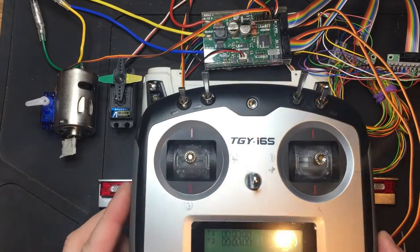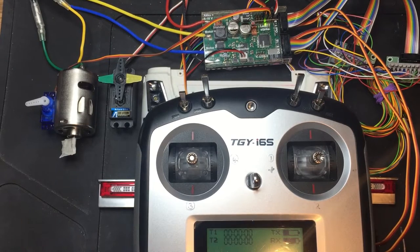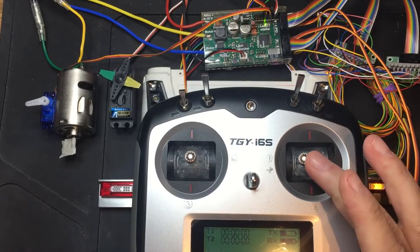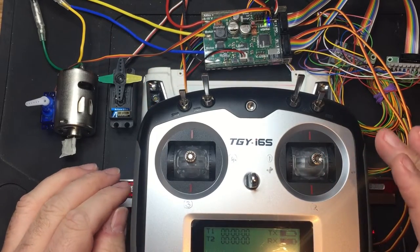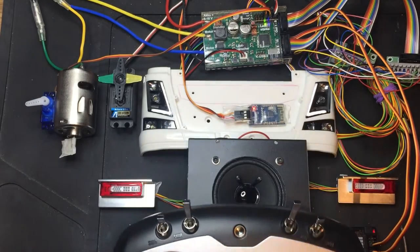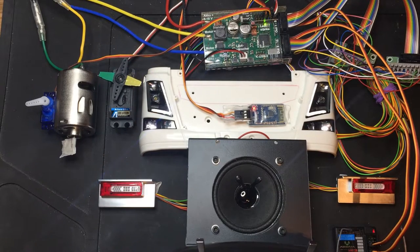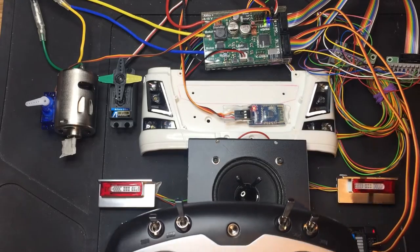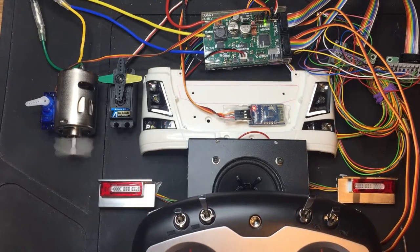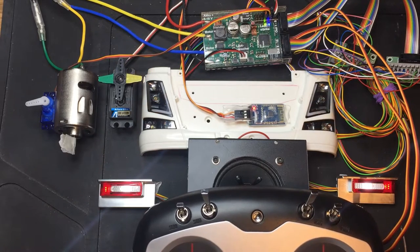So at the moment we have steering — we have left movement on the servo here and we have right. Now this will be an indication of if you only had a two channel radio, and you can see here it is actually doing the bending lights and the indicators, because that will all work off the prop one and prop two inputs. So prop one being throttle and prop two being steering. I have my channels one to one and channel three to prop one input. I can have forward, I get my brake lights, I have reverse, I have my brake and I have stop.